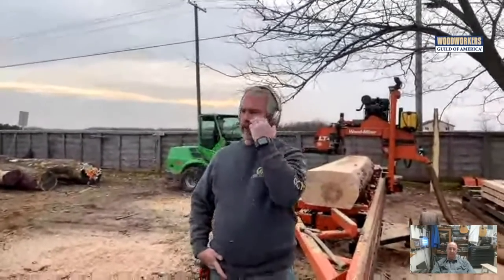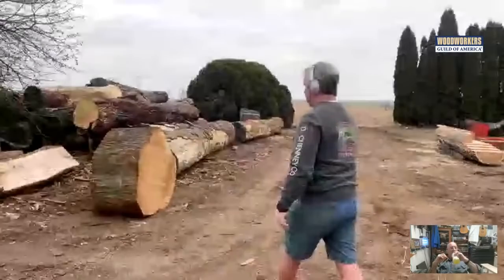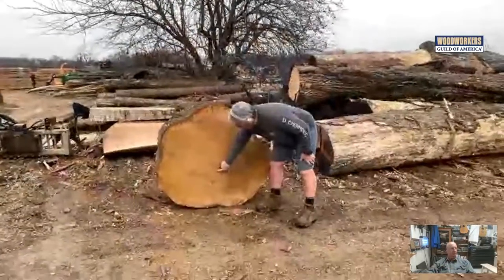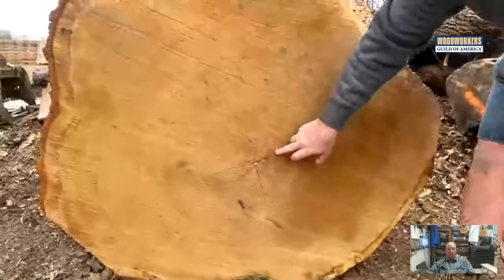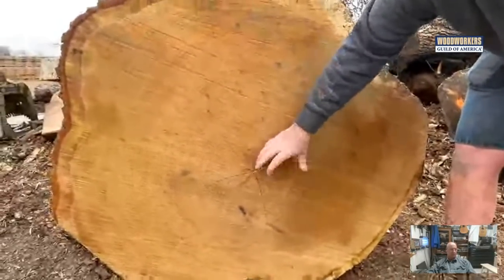Yes. And most every tree has what they call a wind shake. And that wind shake stems from that heart. So you get a lot of cracking. I don't know, Hayden, if you can follow me over here. We have a cross section that we should be able to see. This is that heart. Hayden, can you zoom in here? Thanks, buddy. But you've got this cracking, this wind shake, and that's your heart. If you would keep that lumber, you're going to have a bunch of cracks and shakes.